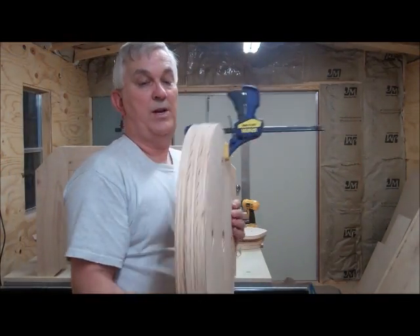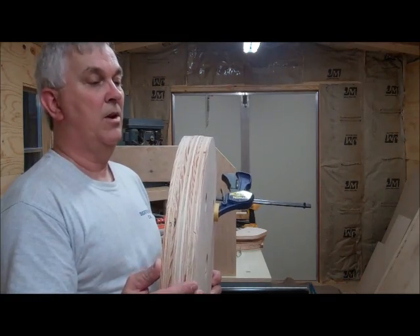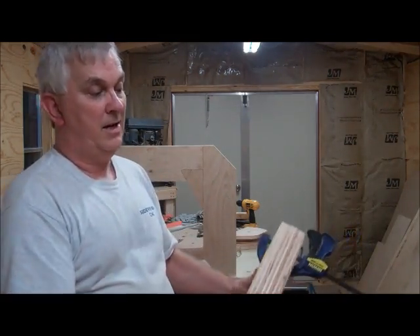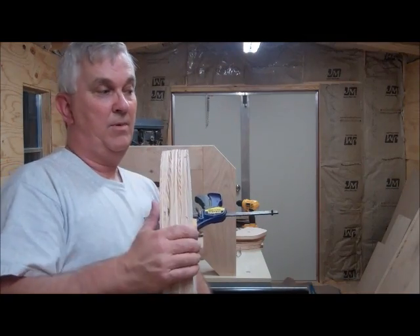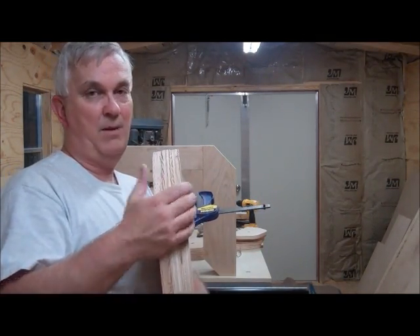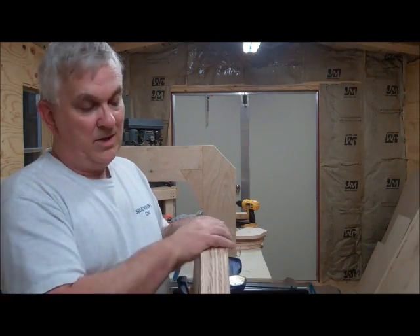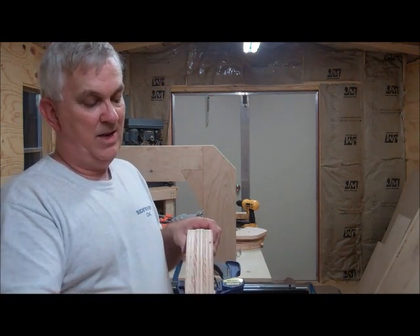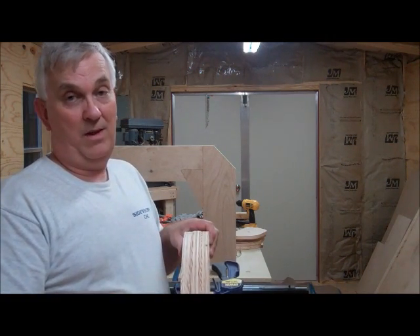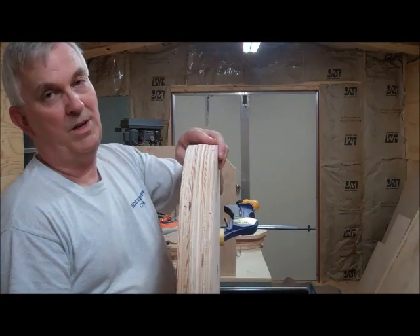The other thing I wanted to show you about these wheels - the center wheel I cut at 19 inches in diameter. The two outer wheels, the inner and the outer, I cut an eighth of an inch less, so they're 18 and 7/8 inch diameter. The reason I did that is because I want a crown on here. What I'm going to do is use my CNC machine to make a sanding block with a nice rounded crown, then figure out a way to attach this to an old motor and get it turning. I can just put that sanding wheel on here and let it sand these outer edges. Since the middle one is sticking up a sixteenth more than the other two, it'll be a little less sanding that way.